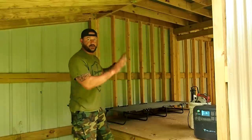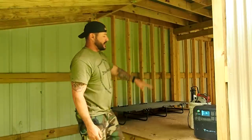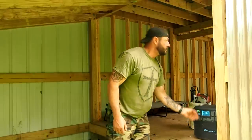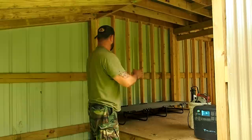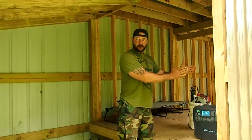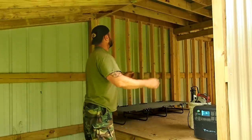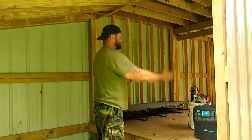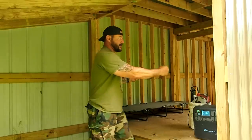Last time we talked about putting a wall in right here with some type of slider. I want to frame this bad boy out, do a little bump out, a little pop out about right here, and have an opening about right here so I can slide a door this way. So you want to offset the framing and leave enough room for our actual 2x4 door. And nothing special, probably a good 36 inches wide, about right here. So when it's on this side, I can actually grab it and slide it across.